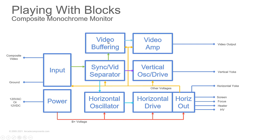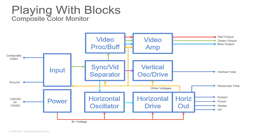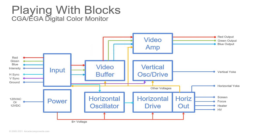So very simple. Very much similar to the building blocks for the other monitor. Now we jump over here to the CGA EGA digital color monitor, and it's very similar to what you saw on the TTL monochrome, except we're tripling some of the circuits. So the horizontal oscillator, we still have that, still have horizontal drive, still have horizontal output,